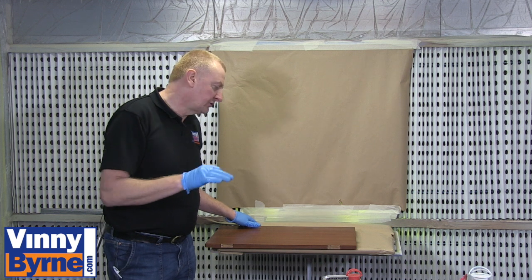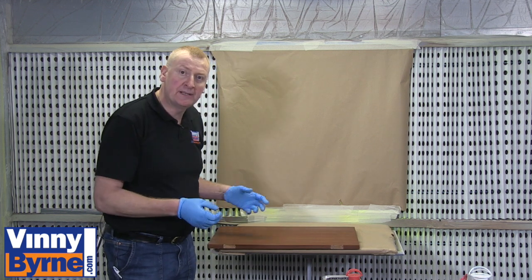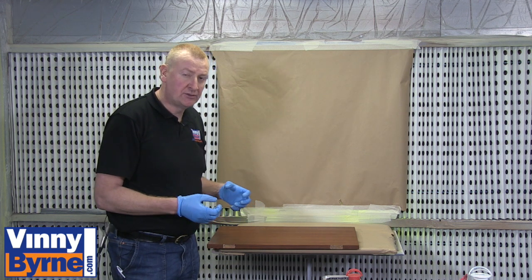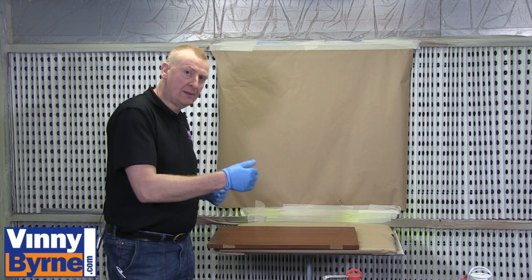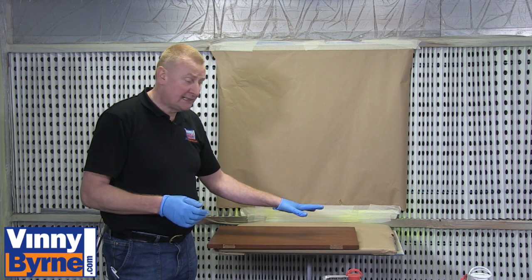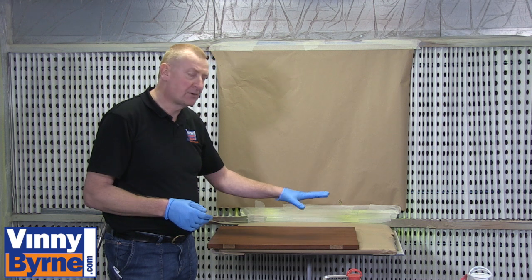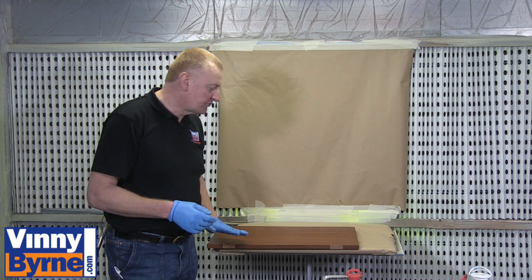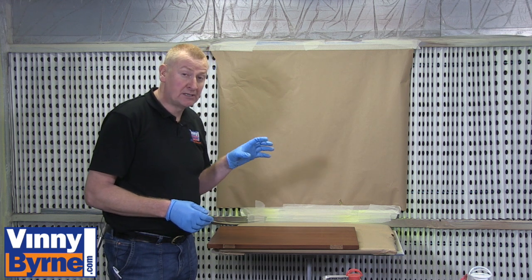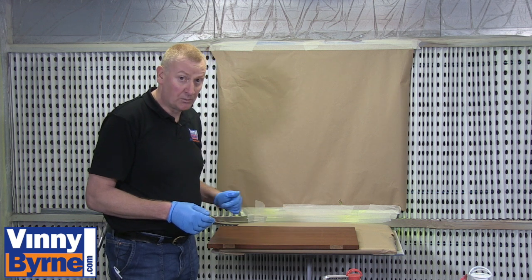Another thing to mention: you should always do a check if you're painting something that has been previously painted, lacquered, or varnished. They may have used a cheap product before that hasn't fully cured, so if you go ahead and paint it you may have paint reactions. Do a simple little test in the corner — see if you get a reaction or swelling. If you do, you must remove that clear coat or varnish. That means more sanding and using nitrocellulose thinners to completely remove the old coating.